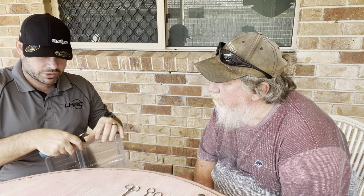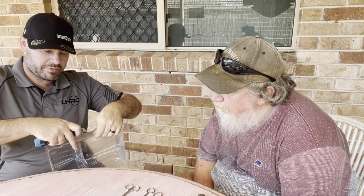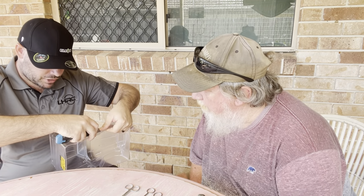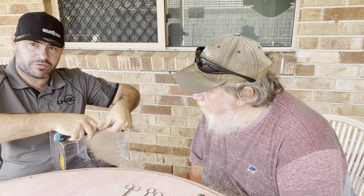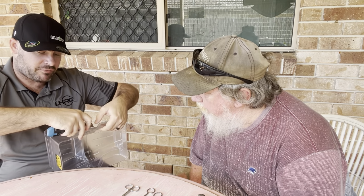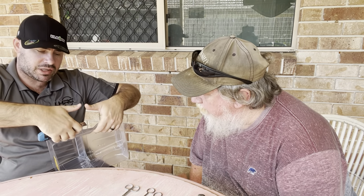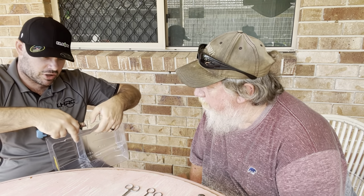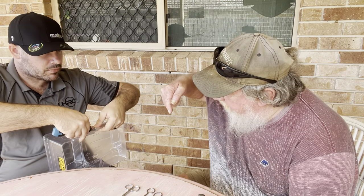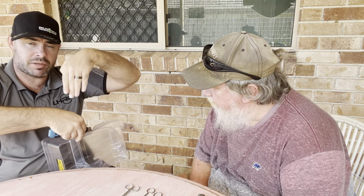What I do here is I've still got my support finger here, but I've also now got my thumb on the tip of the blade, because I'm now pushing. I'll let Bruce see that so you can show other people. So I'm now using my thumb to push, and I'm using this finger to stop. So it's a push, it's not a push pull. I'm not using the knife to cut now. I'm physically pushing the blade into the divot and then releasing the pressure from this hand and the finger to hop it back out so that we can marry up the cuts. So you're basically allowing the blade to go down, in, follow the line, and come back up where you've got full control. So we're pushing the blade into the groove.